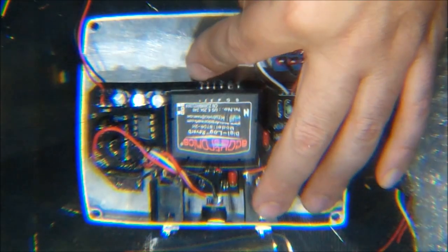I didn't have voltage on pin 1, which is plus 5 volts. I looked this up. I got the little thing for the reverb module, and I realized that there's supposed to be 5 volts on pin 1. I checked on the pad, I had 5 volts. I checked up on the pin, I didn't have 5 volts. Well, duh, there you go. There's why it's not working. So let's talk about where the wires on this go, because that's probably what everybody's going to want to know.